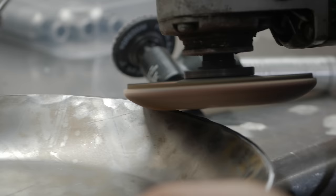Next step is to get a drill bit in — this is a quarter-inch drill bit for our quarter-inch rivets. We're actually going to drill these out real quick because these are just rough. Now we're going to go ahead and rivet this. I've got the rivets in place through the holes coming out the backside, and I'm going to cold rivet these — just put it over the edge of the anvil, a nice solid surface. You can see that line going directly down the handle, right onto the center. And that is good to go.